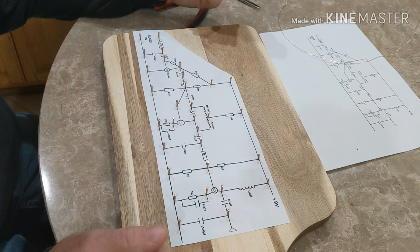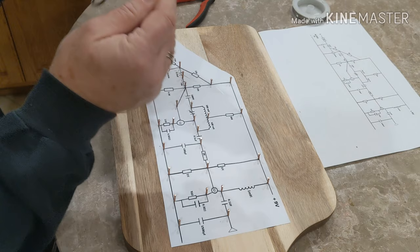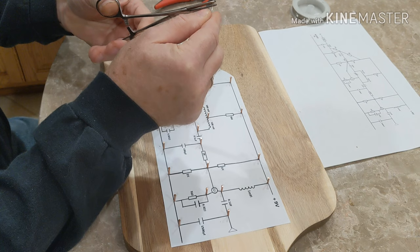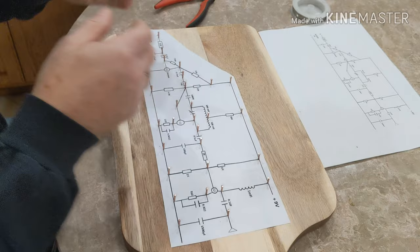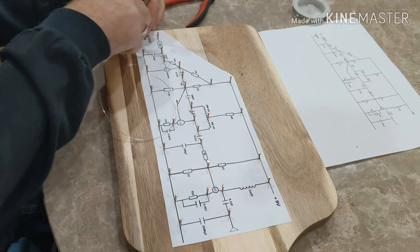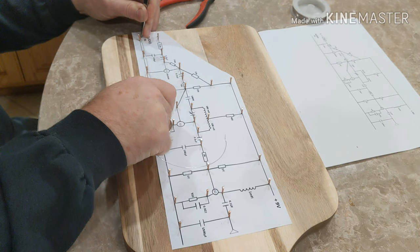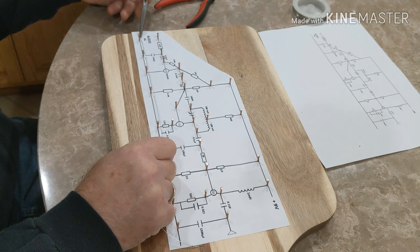So what I've got going here is a roll of tin copper wire — nothing special about it. I cut off a piece so I didn't have to mess with the roll. George showed this little trick when he was doing his — pull it tight to basically straighten it out. So that's what we're doing here. I've got some hemostats I'm going to use to help me wrap it around these terminals today. Basically what we're going to do is just wrap it around each nail like so.